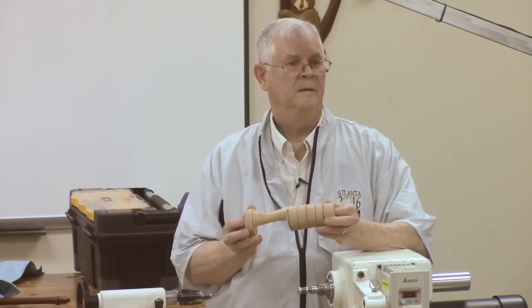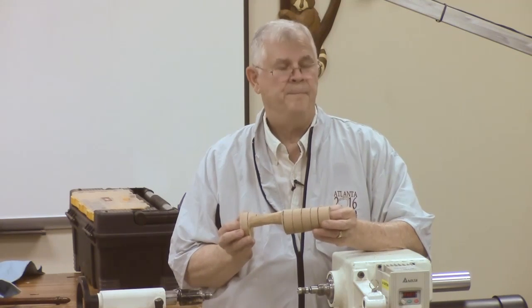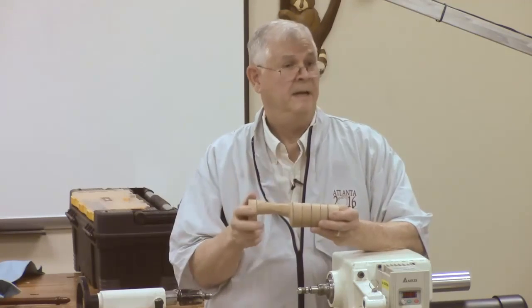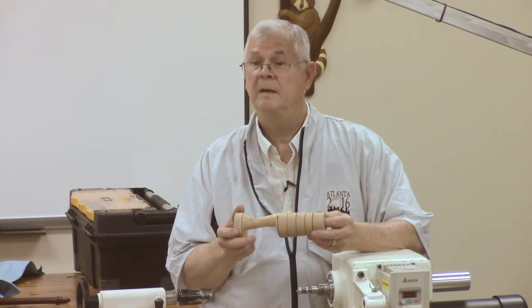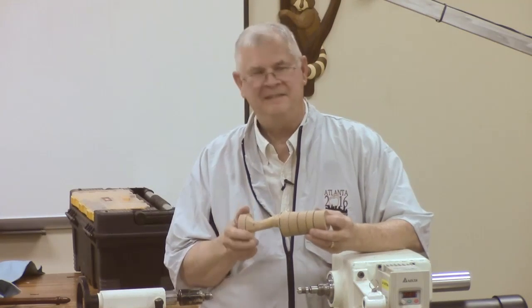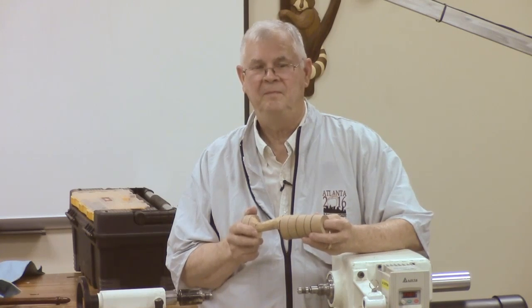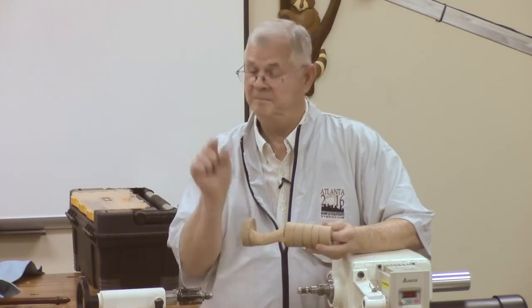If you're wanting it to be more corkscrew, you could use the same holes and just make the segments smaller? Exactly right thinking - remember you've got to have space to work in there, but yes, that's exactly right. Just do it with a parting tool. I hadn't tried that - that's a good idea. It fits in the smallest space. You could go the width of the tool. I'll have to try that and see how it works - that's a good idea. You could really get it down close.